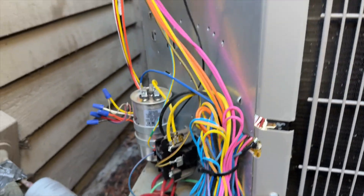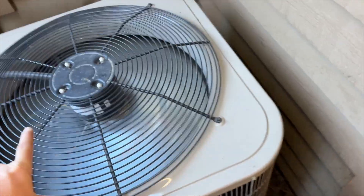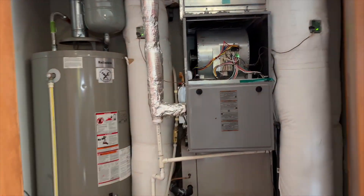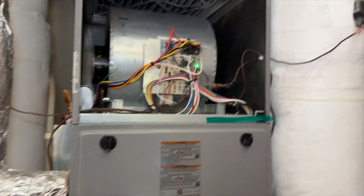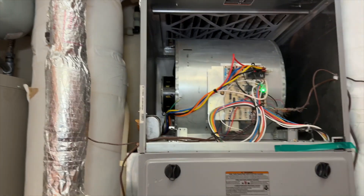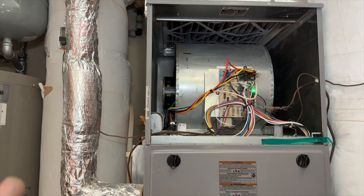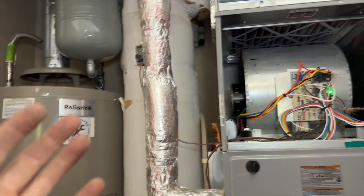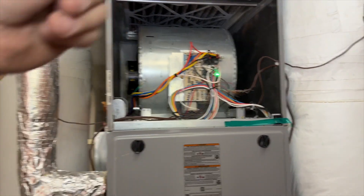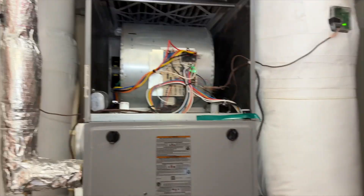Contactor's staying closed. She's all back up and running. It was all because of that short — anytime it called for the outdoor unit it would short out and blow the fuse. The owners are in Canada and were getting an offline notification from their thermostat, which is why they called this out. Sure enough it wasn't heating because the low voltage system had been knocked out.